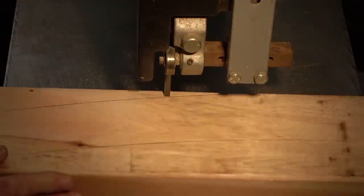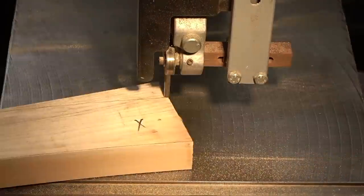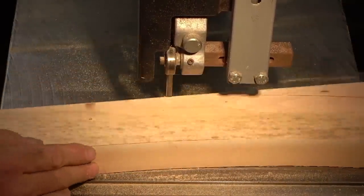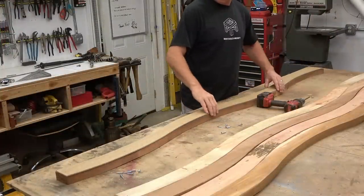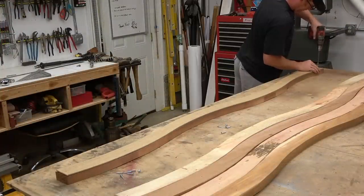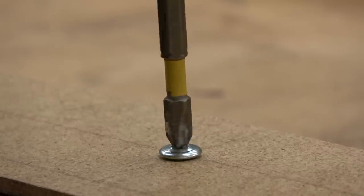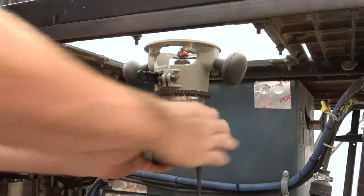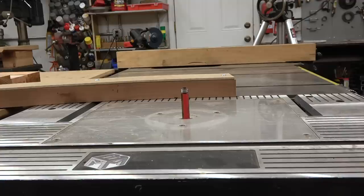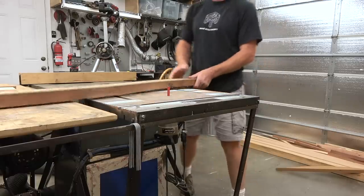When I cut the planks, I'm trying to leave a little bit of wood between the blade and the pencil. That's because I'm going to flush cut with a router, and it's going to do all of the final cutting. If you go past the line, you'll leave a divot you can't recover. I'm reinstalling the stencils, and I like to back the screw up until it falls into the original thread. That way I know the registration hole is lined up perfectly. I'm adjusting this so the bearing rides on the stencil and the blade cuts right at the top of the blank.